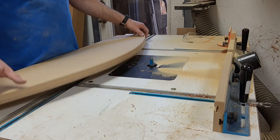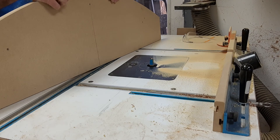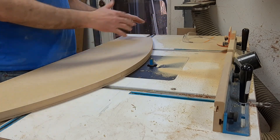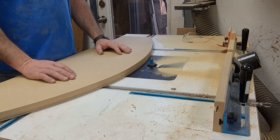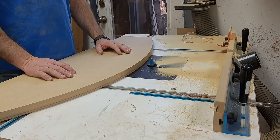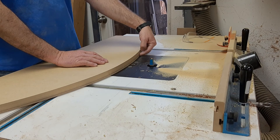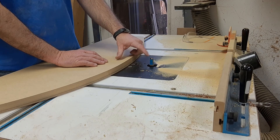So instead, what I'm going to do is back out this part of the template, and then I'll be able to re-screw the first part of the form to the second part, run this over the router table, and then I'll do the same for the third. By doing that I'm able to get where I want to be. The only difference is I need to raise up this bit because the template now is a quarter of an inch, and the next one's going to be three quarters of an inch, so I can get away with it with this length of cutter. If I had something slightly longer, that would also be an option.